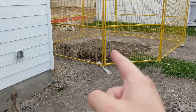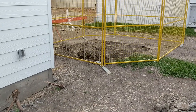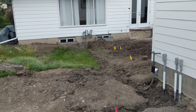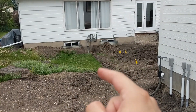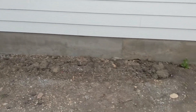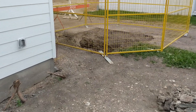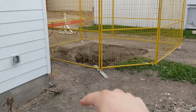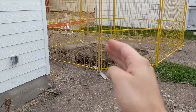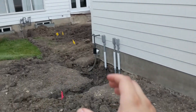What's going on here is that the city went for a dig over our main gas line and then they dug some more because it was a lot deeper than they thought. If you look at that little skinny line out there, that's the main gas line. It's old, it's of the unsleeved variety, and you can't build a building over it. We did, and now we have to get this new one done. So there's been a bit of a delay — they've got to get more different machines, they've got to hydrovac this out, they've got to shore up the sides so it's safe to work in there. They'll take care of that tomorrow, and finally when that's done we can address the final concrete in this area.